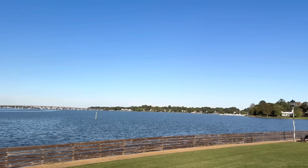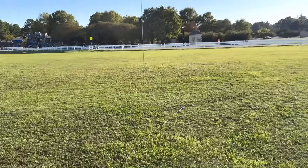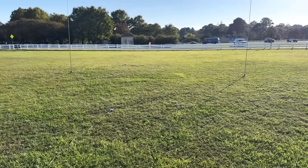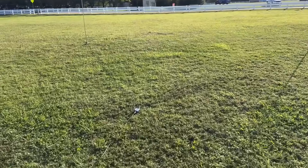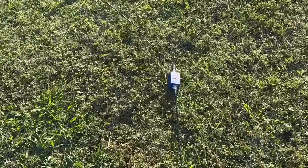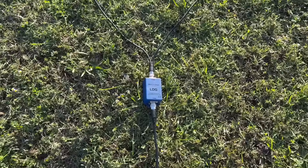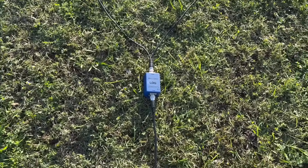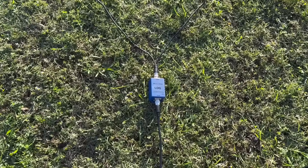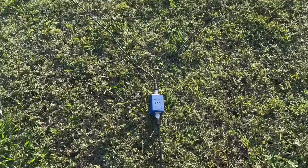Here we go from what's becoming my favorite spot because of all this turf out here to play with antennas — Portsmouth City Park in Portsmouth, Virginia. This is my 50-ohm coax going into a choke. I used a choke because I couldn't find my barrel connection, and I figured a choke would be a great place to make the transition from 50 to 75 ohms.